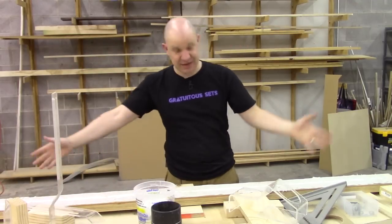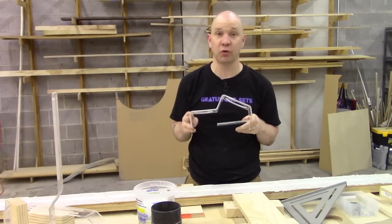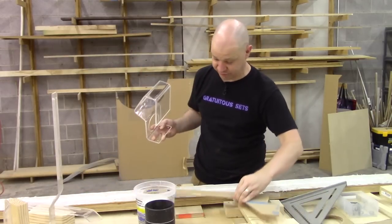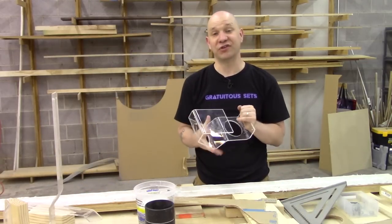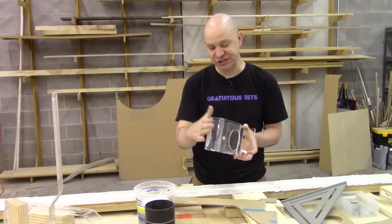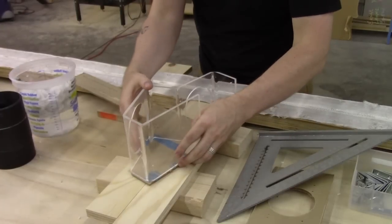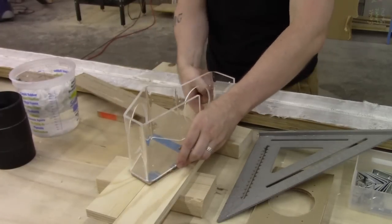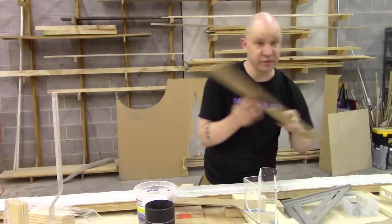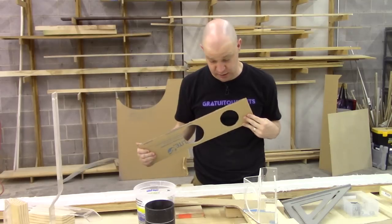So, line bending. This is a line bender — you can probably, based on the name, tell what that's going to do. I did this one a week or so ago and it came out honestly pretty well, considering I'm not great at this. It's more art than science, and I didn't have the space that all my bends are going to take up exact, but I came pretty close. So we're going to peel the plastic, put it on the bender, and start bending. On my cut, I went and put in dots where each bend should theoretically be starting and stopping, so I can take those dots, get them lined up and square.